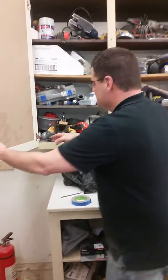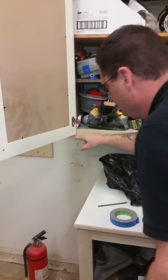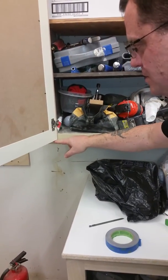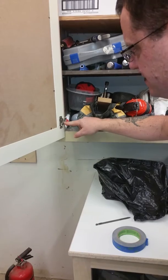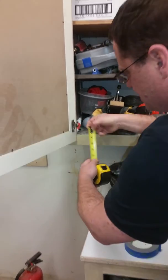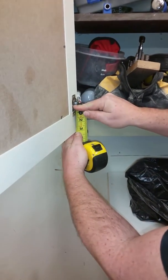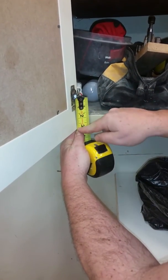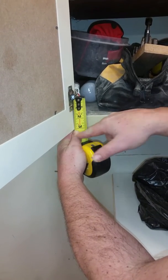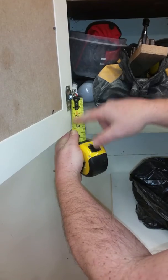Basically, I'm going to need to know from the bottom of the door to the center of the hinge. There are all kinds of little centers you can measure to — the center of the screw, whatever — but I need the distance from the center of the hinge to the bottom of the door. I did these at three inches, so I know that's three inches.